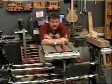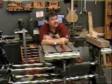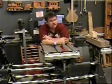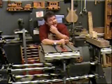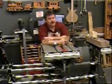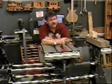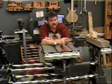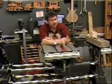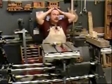The reason that you tighten the bolts in two different orders is just to try to evenly distribute the pressure as you're bringing the bolts up against the trunnions. It really doesn't matter as long as you increase the pressure on each bolt in some sort of a different pattern each time you go around it. Snug it up first and then tighten it with the wrench. The table won't move on you. And that's it. That's all there is to it.